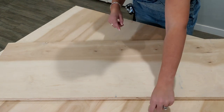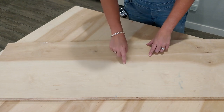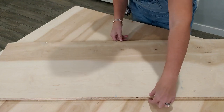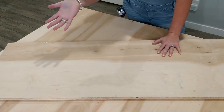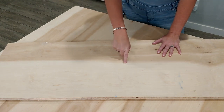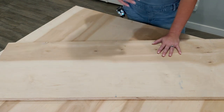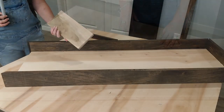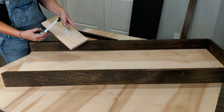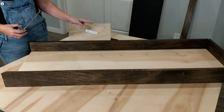The pieces we ended up using were cut from a four-by-eight sheet of three-quarter-inch maple plywood. When we looked at it we realized how extremely flat it was. This remnant piece cut to our dimensions — you can see it's completely flat against the surface underneath, no wobbling, no warping, and it's the thickness we needed. The whole sheet was about $44 at Lowe's, which was less than those other warped pieces cost. Don't make that mistake. Also, Lowe's will cut these sheets for you if they don't fit in your car or if you don't have a table saw — they did ours in three rips.